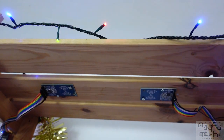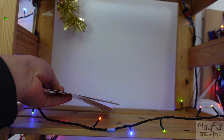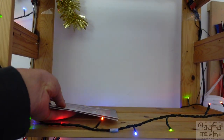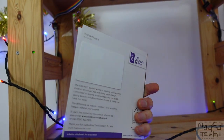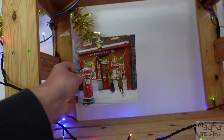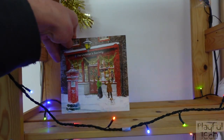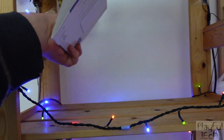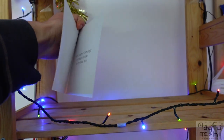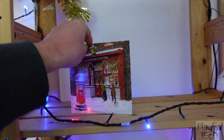This means they have a greater range. Rather than having to be carefully lined up flat on top of them, the card containing an RFID tag on the back can actually be stood at quite a range — a distance of around 20 to 30 centimetres — and it doesn't actually have to be flat to the sensor either. I'm standing them at 90 degrees and they're still being detected perfectly well.